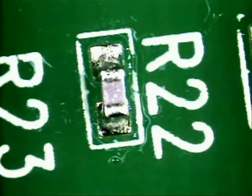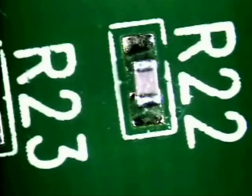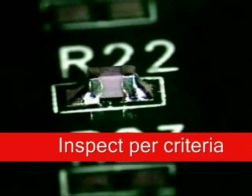Next, clean the area with alcohol. Return the soldering iron to the station making sure the tip is pre-tinned. As a final step, grab your acid brush after immersing in the alcohol and clean the site. I recommend putting your board up at an angle, just like so.